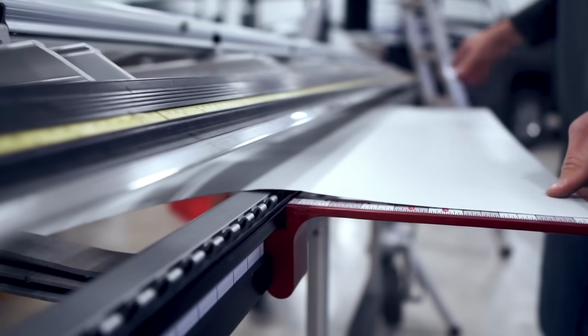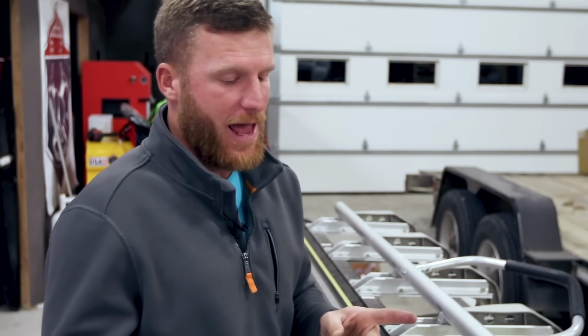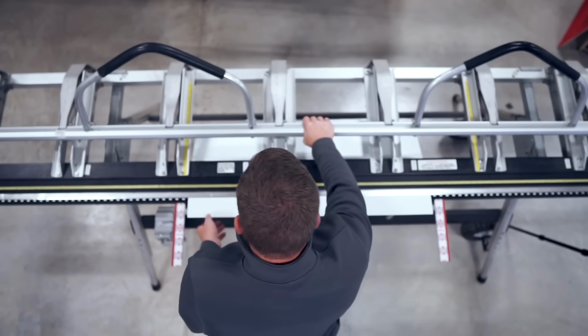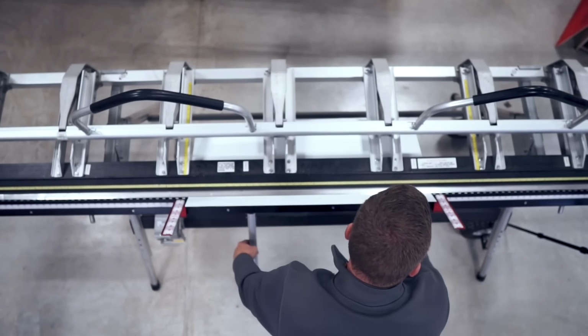All right, the last bend I'm gonna do is one that always boggles my mind right away, but once you do it a couple times, it gets a lot easier, and that is an outside corner trim with a built-in J-channel, so that way you can hide that vinyl or whatever that siding is that you're putting up. So this time we are not going to start with that hem. What we're gonna do is start with a 3-inch bend. So we're gonna set our piece of material at 3 inches, and we're gonna do a straight 90-degree bend.